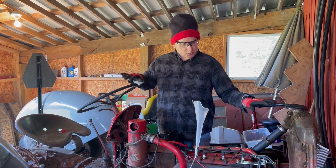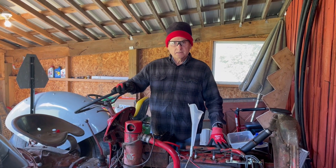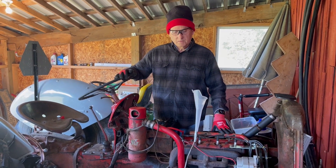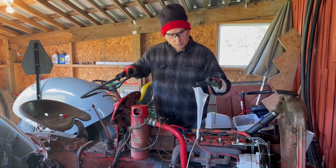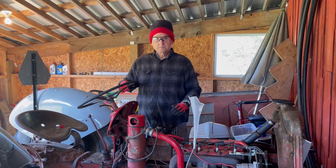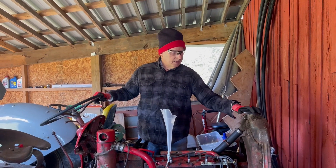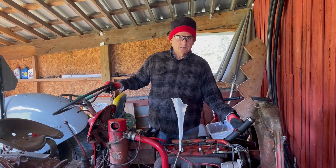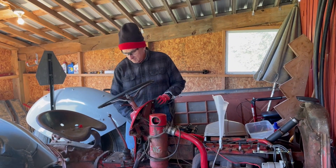We have the hood off to be able to do this conversion because you can't get at everything with the hood on — the gas tank is attached to the hood. Right now we have a funnel system going to the fuel line to the carburetor. I just hooked a little funnel here and poured enough gasoline in to get the line filled up and into the carburetor. There's only a set amount of gas, so when we turn it on it will only run for a short period before running out. We also haven't put any water in the radiator yet, in case we had to undo something. We can run the engine for short periods without coolant.